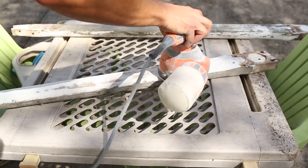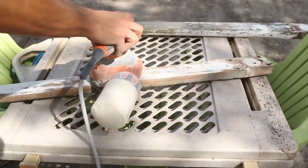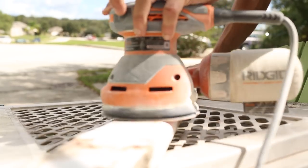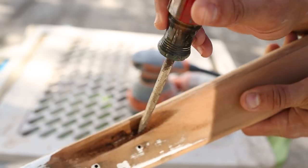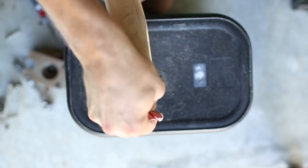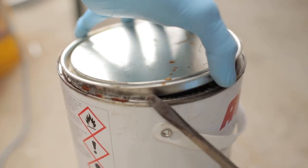These spreaders look like they haven't been touched since 1971, so I decided to give them some much needed TLC. Found some wood rot — created a teak plug, filled everything with thickened epoxy, and now it's time for some paint.